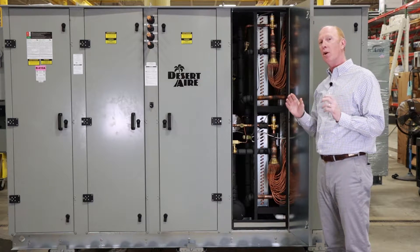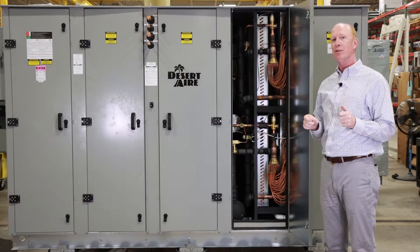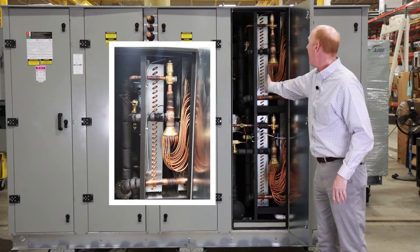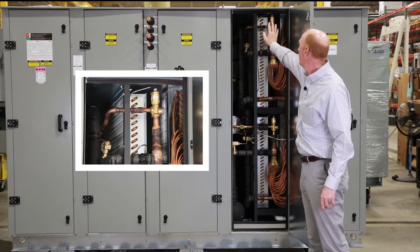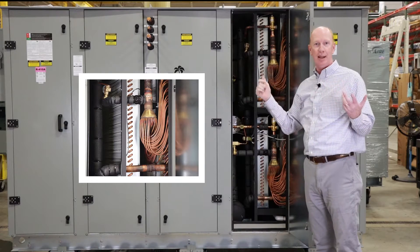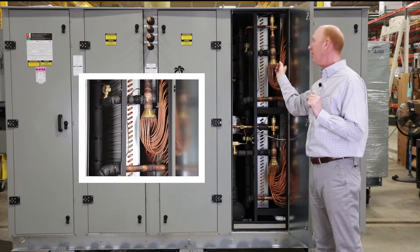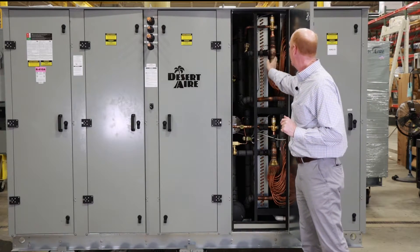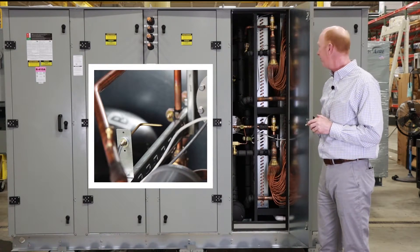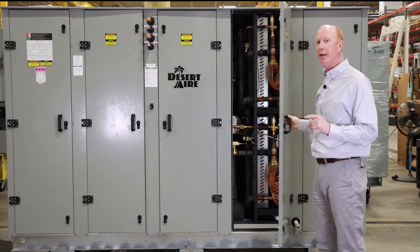The big difference between the grow air and the total air package is that these larger sizes — 36 tons up through 60 tons — are two-circuited machines with two stages of operation for each circuit. You can see we've got a top deck and a bottom deck: the B circuit is on the bottom and A is on the top. We've got electronic expansion valves on the A circuit up top and the B circuit below, with distributor feeds going into the evaporator coil. The reheat coil is full-sized for total heat rejection. We're measuring differential pressure across that reheat coil to understand airflow through the unit, with pickup tubes on each side. You can also see sight glasses for the B circuit, and there's an A circuit sight glass just inside the cabinet.